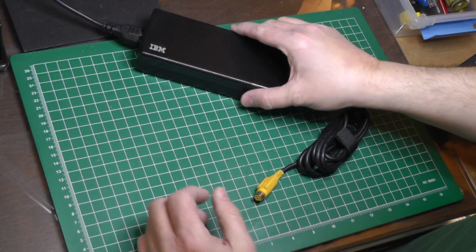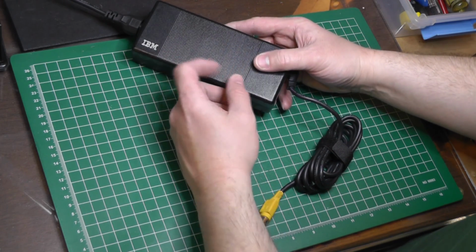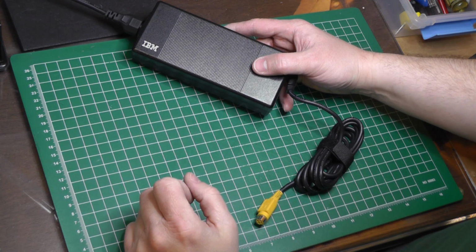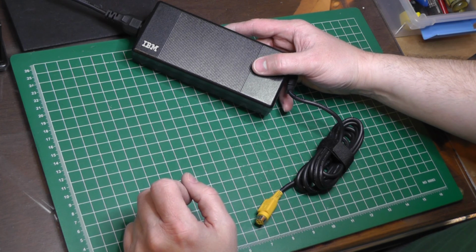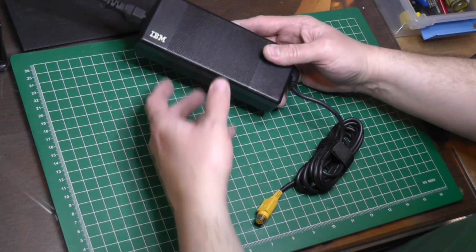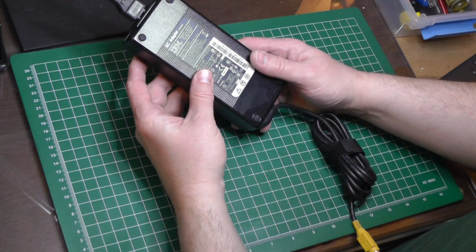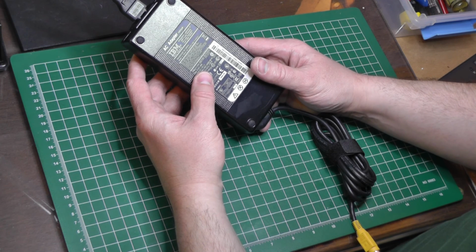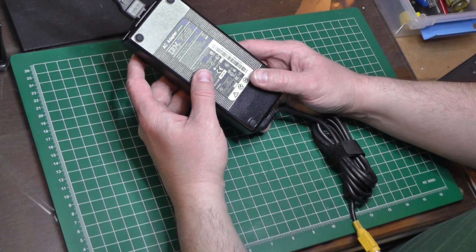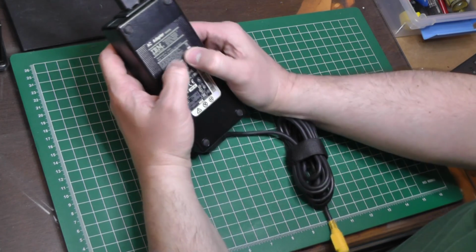5 amps or something. So I was running them right now off of the MTH accessory port for the 14 volt, and the max for that is supposed to be 3 amps, and I'm running almost 5 amps out of there, so I don't know what the story is with that. So anyway, I was hoping I could find something that would be about 16 volts instead of 14 volts, so they'd be a little brighter.